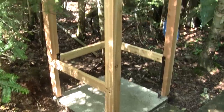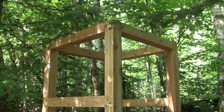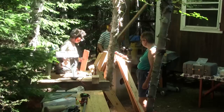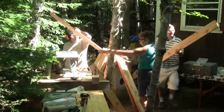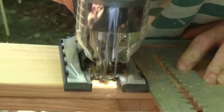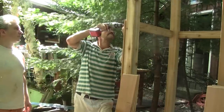Finally, all the structure is in place. Not bad, but it's not over yet. We need to transform this pile of wood into the shower's walls. While René and Philippe rout a round-over on top of the planks, I cut them to the right length. Then we screw them in place.